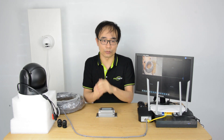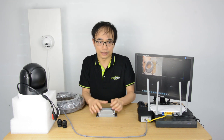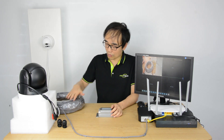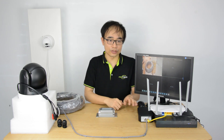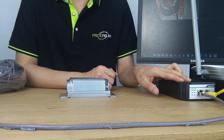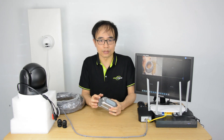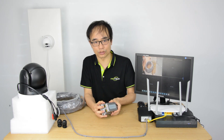You may be thinking about how much power this device can provide. After all, this is a PTZ camera — it's a power-hungry device. Fortunately, the PoE extender supports the IEEE 802.3BT standard, which uses all four pairs to transport both power and network. If you are using a PoE injector that can output 95W to a single port, you are going to have 30W output for each of the PoE ports.